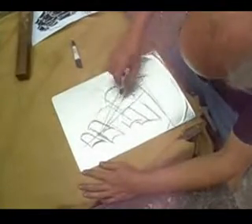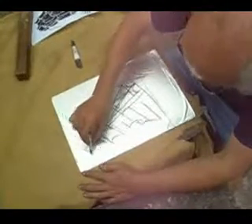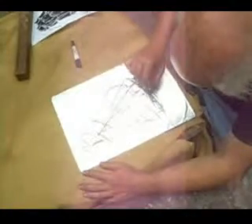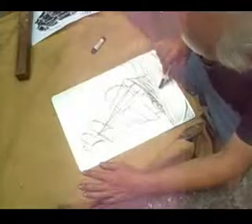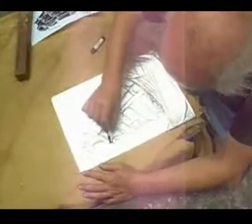Try not to touch the surface of the aluminum with your fingers, because fingers have fat and those parts will be printed as well. The surface is not exactly aluminum — it's aluminum oxide. The aluminum oxide you can see here reflecting the light is lipophilic, attracting fatty substances. So you can paint with fatty pencils or ink, nearly any material which is not soluble in water and tends to be lipophilic.